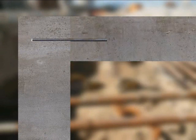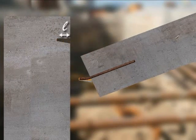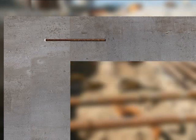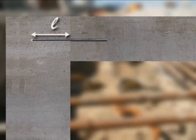Pay attention to the depth of the anchoring. If the hole is too shallow, the bond may not be secure. Here the link is secure, but there is no load transfer. The correct anchoring depth should guarantee the link as well as the load transfer.